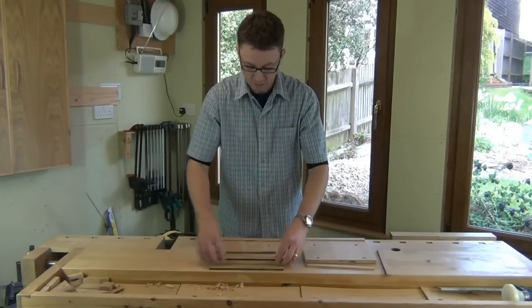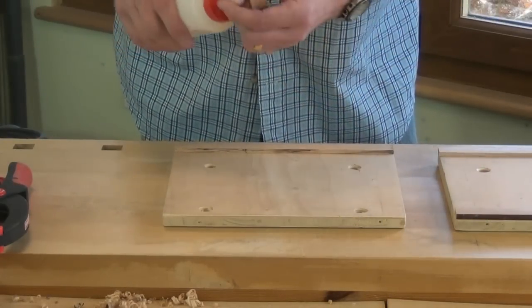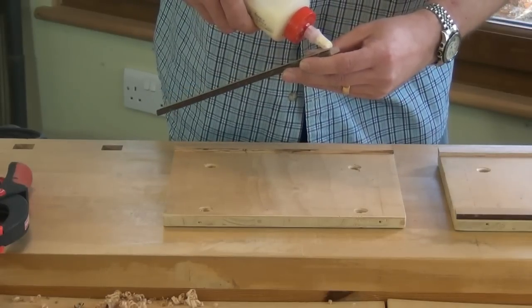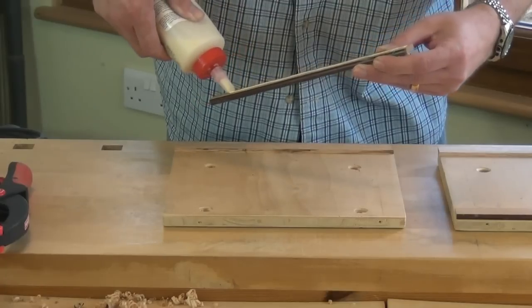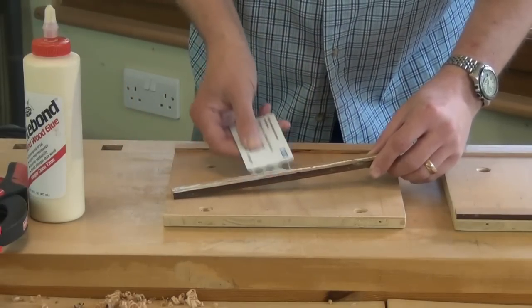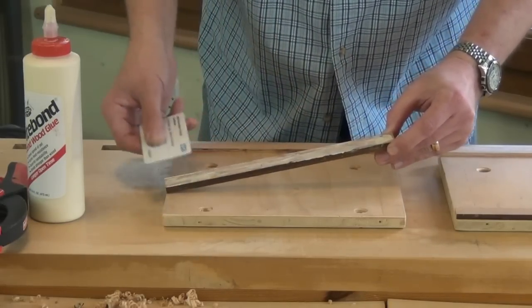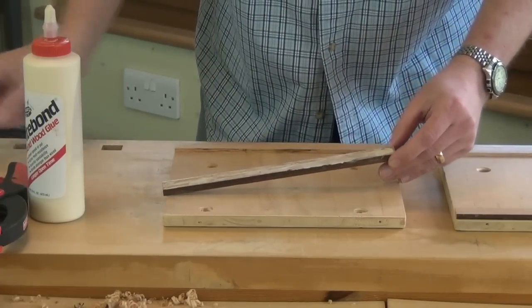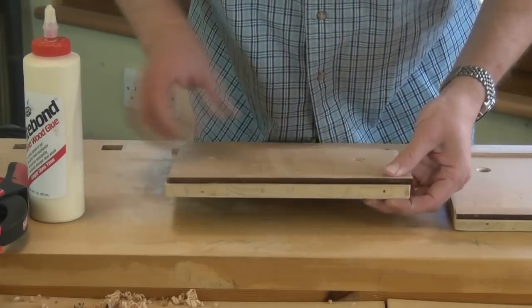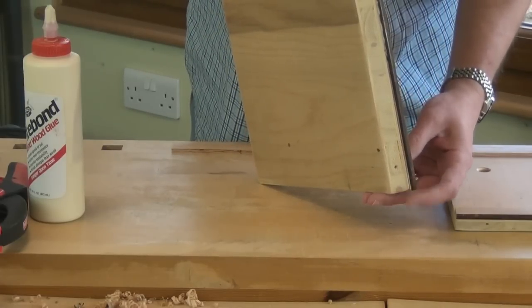These wider ones at the tops of our vise boards. So we are going to glue these battens on. This top batten we shall hold back slightly so it overlaps the bevel. That way when the glue has gone off, we can come in with a hand plane and match the bevel that we made on the vise board. So we just let that protrude over the edge a tad.